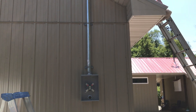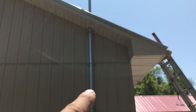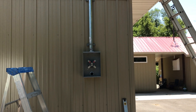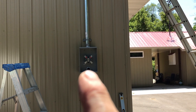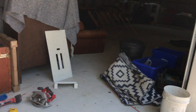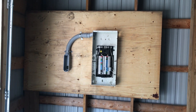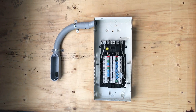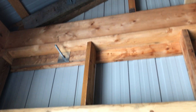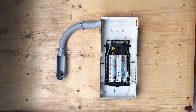That's your 10-minute video of your DIY 200 amp panel upgrade. Establish your mast first, then coordinate the meter base — make that hole before you mount the meter base because it gets really tight. Thanks for watching; I hope you enjoyed that. It's not that hard, guys. The hardest part was mounting the mast and I was by myself, but it is rock solid. Very happy with the way it turned out. Have a super day everybody, take care.